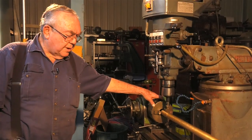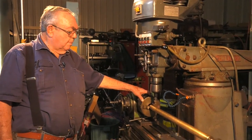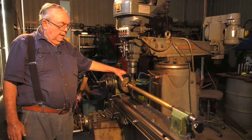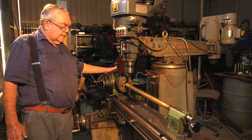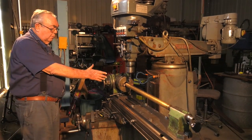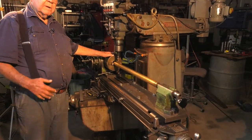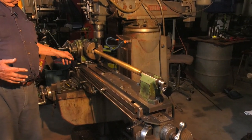This machine has a travel on the table of about 650 millimetres, and the job requires a 600 millimetre flute, which is getting pretty close to its capacity. The dividing head, as such, takes up room. I suppose it would be 300 mil, maybe a little more, or a foot, and then the tailstock has to be bolted somewhere too.